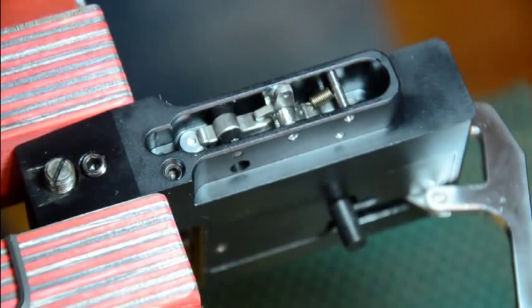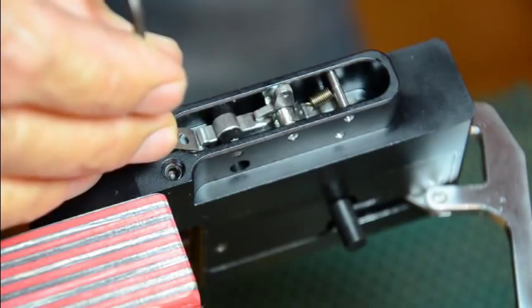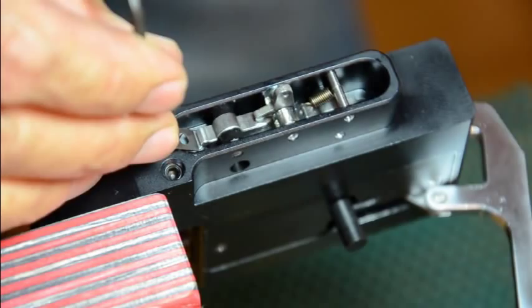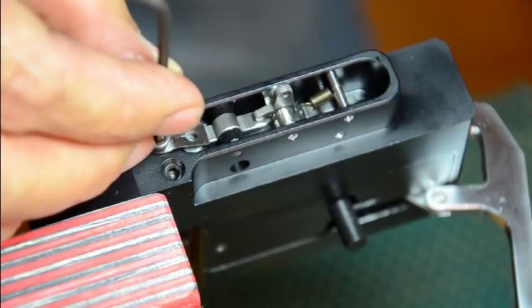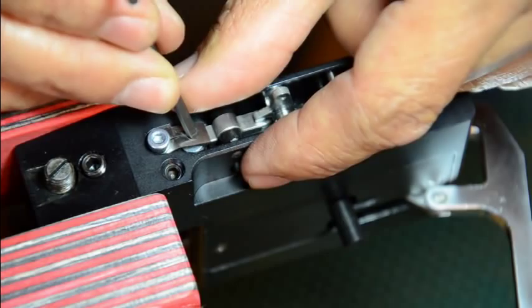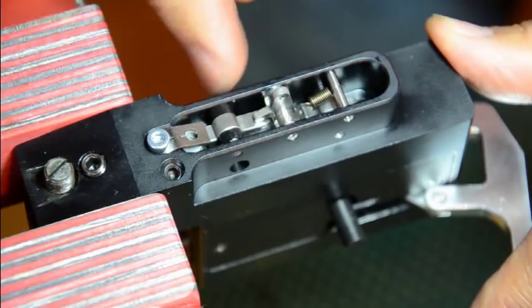At this point, we're going to put the leaf spring adjustment screw back in. As soon as you feel tension, the spring is acting like a spring against the shear. You want to do one full turn. We'll adjust that later. I'm also trying to keep it aligned so the Allen wrench will fit through this hole and turn the adjustment screw for the second stage.